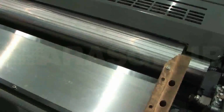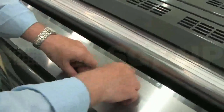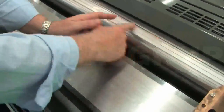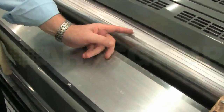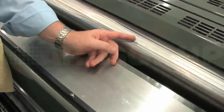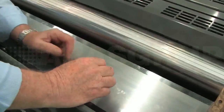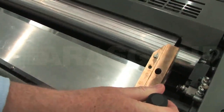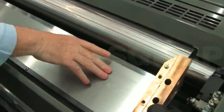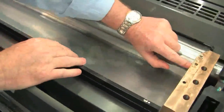This is also part of the KHSAI system. Imagine that over a repeat of a few jobs, this key gave a little bit more yellow ink on this ink fountain, for example. The PDCS would modify those automatically. It would then speak to the KHSAI and say to the AI, I modified that yellow. And the AI would say, okay, don't modify it next time, I'll modify it. The effect of that is that we no longer have to zero these ink keys continuously. The zero position, the working position of these ink keys, is now controlled by the KHSAI. And the reason we can control it is because we have a perfect fit between here and here.